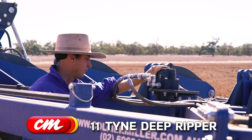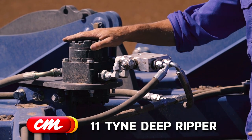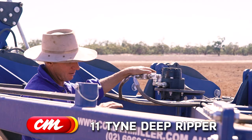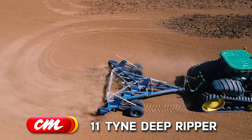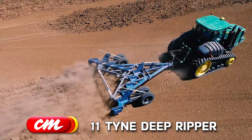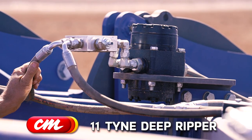This machine has a hydraulic rotary equaliser so you don't need phasing rams. The machine is quite heavy, and when you lift it up and put it down it's splitting the oil equally, which no doubt helps avoid needing phasing rams and also helps prevent seals blowing out and things like that.